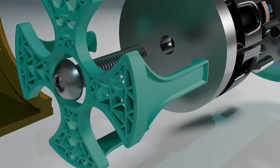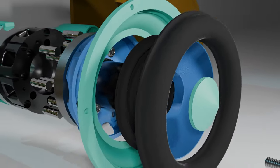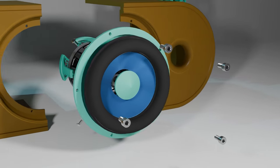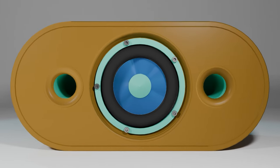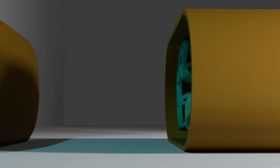It also uses 48 N52 neo magnets, which is comprised of 16 sets of three, and they are arranged around the center with two sets of three in line with each other, forming eight sets of six. It's very confusing, I know. The plates used are 3/8 inch thick for top and bottom, and multiple 1/8 inch plates make up the center pole.